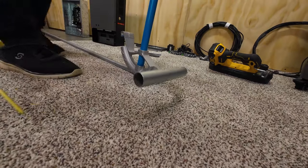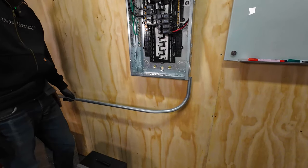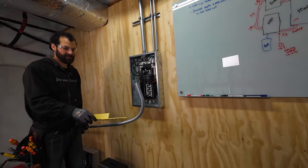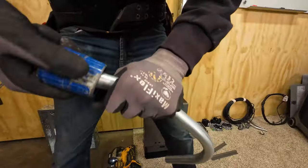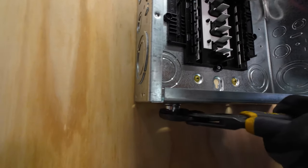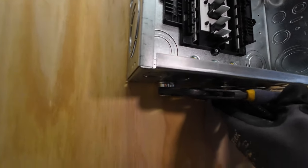Let's give that a look — that's going to be pretty close. I'm actually going to knock out my knockouts and assemble this with the option of coming back and giving that a little bit more love if required. Fittings like this are required to be tool tight or wrench tight. What I like to do is have my fitting about 90 degrees shy of where it's going to land when it's hand tight, then coming back with channel locks bringing that set screw straight out and perpendicular to the wall for a nice clean finished look.